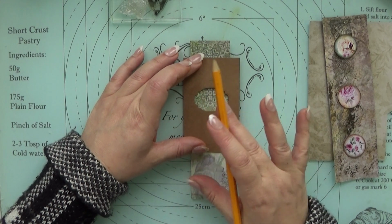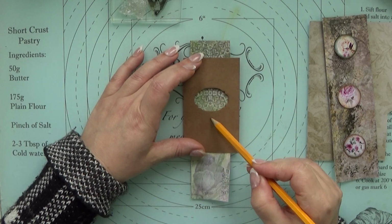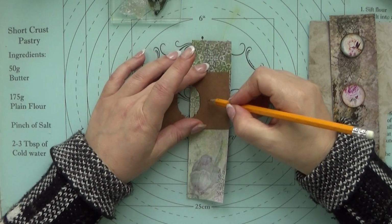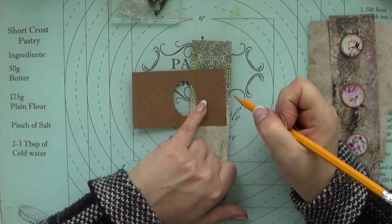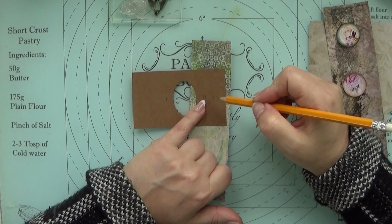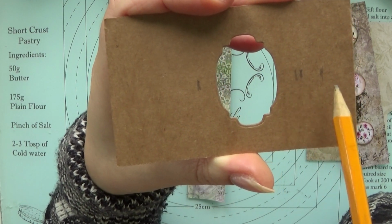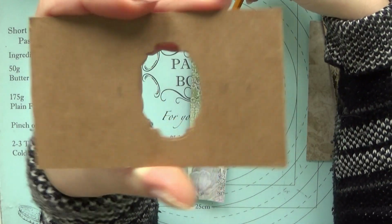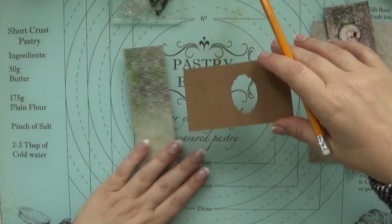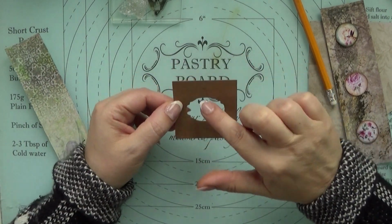I need to leave enough room that it's not going to break and it's not going to get structurally damaged when I put in those slots, because those slots are quite large and we'll have little pieces left either side of it. So we need to make sure it's stable enough. If I want my slot to be here, and I'm taking a piece out, let's say I'm leaving 1/8 of an inch for my slot, 1/8 of an inch wide, and I need a piece that's at least 1/4 of an inch above again. Now I'm marking this because I'm just trying to show you guys. So here is where my slot is going to go, and here is the height I need to be behind our base piece. So I'm going to cut it here, and I'm going to do the other one similar, if not the very same. So that's going to be the size of our piece, and the next thing we need to do is to cut our slot.